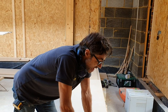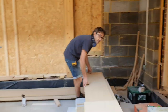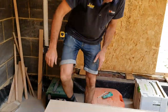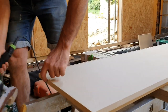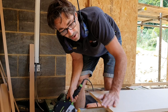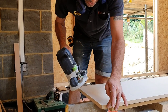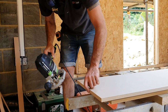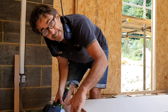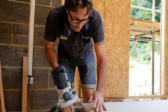The final piece for this board will be biscuiting the other end. I use a router instead of a biscuit jointer — I've got a continuous groove in for three biscuits. The PU glue will completely fill that up, and all I do is align the back of the router with the bottom and the top of the router with the top, which gives me just the right amount of groove. I squeeze about three or four biscuits in there. I prefer a biscuit joint to anything — it stops me having to cleat it behind or use face fixings like screws to hold it back.